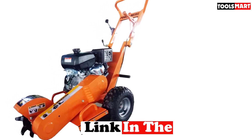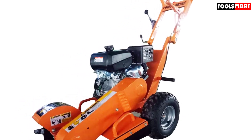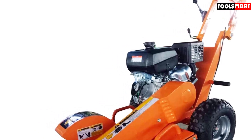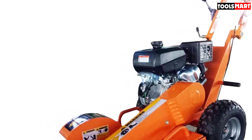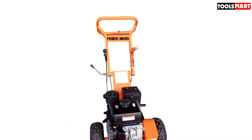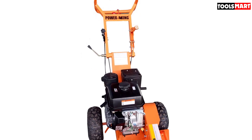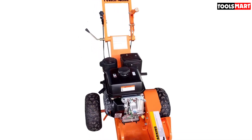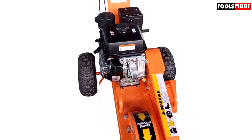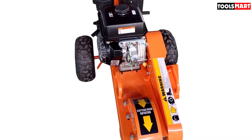What I like about this product: the Kohler engine installed in the PK0803 is popular among landscapers and gives a feeling of assured performance — and that's exactly what you get. The 14 HP Kohler engine channels power without bogging down to pulverize stumps 11 inches above and cut 9 inches into the root system. For a grinder with such enormous power, it has a matching heavy-duty handle for stabilization while it voraciously eats through stumps. This may seem like a simple feature, but it's hardly seen in most stump grinders, even more powerful ones, making it easier to handle.